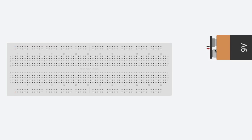The first thing I want to do — this is my power supply showing a battery. You can use a regular power supply if you want, just connecting the positive and the negative in the same way. I'll have a wire going from the battery snap to that dot right there — it could be any one of these holes, it's just closest to the battery. Connect the negative wire to the other row. Now this top row is ground.